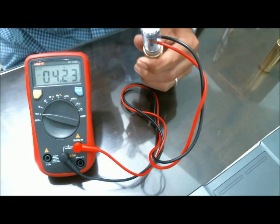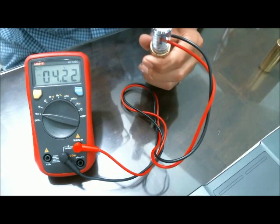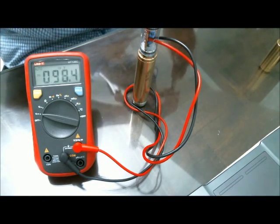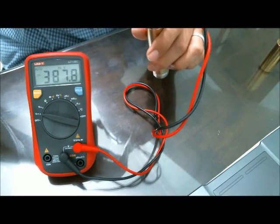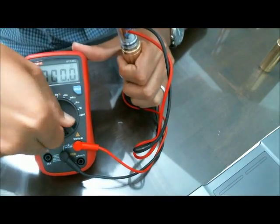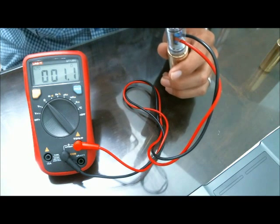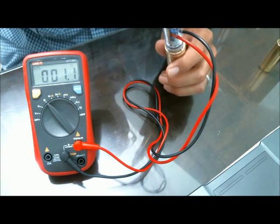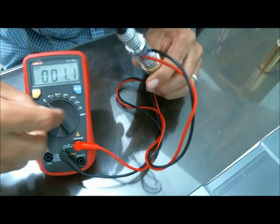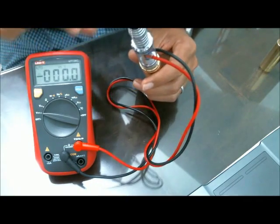So as is, this is fresh from the charger. 4.234, about there, 4.22. Let me hook up my atty here, and we can measure the resistance. This is a new coil on this one, so yep, as I expected, about 0.9 to 1.0 type of atty, a dripping atty with silica wick. Alright, so 4.22 unloaded, fresh battery.